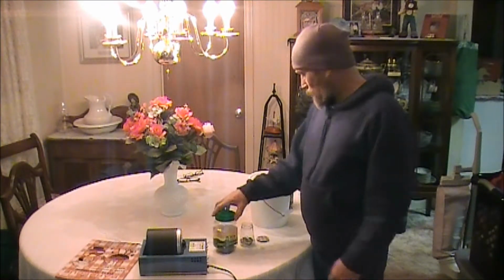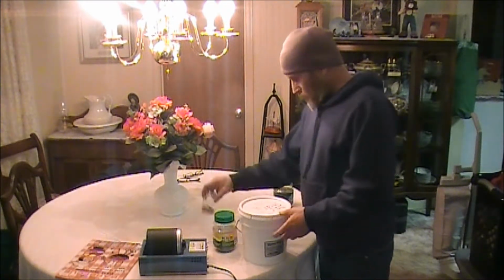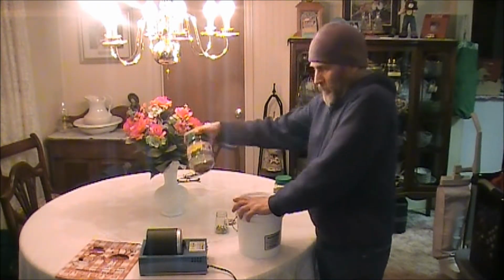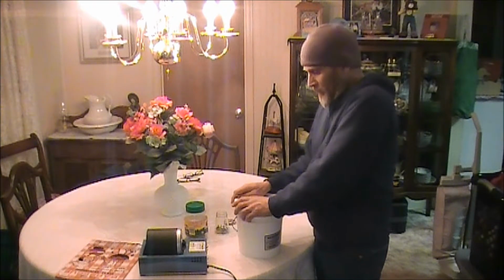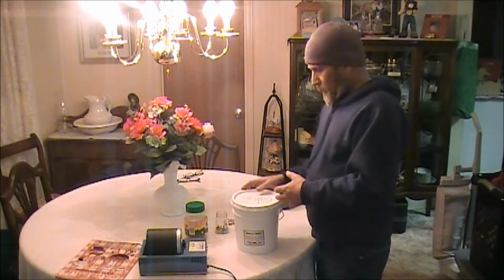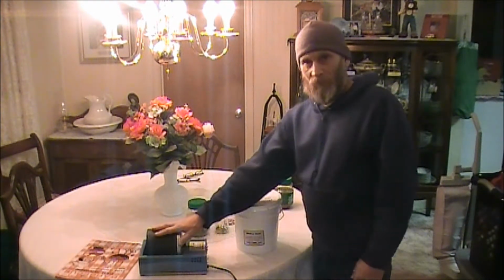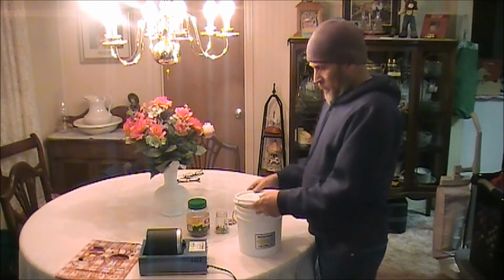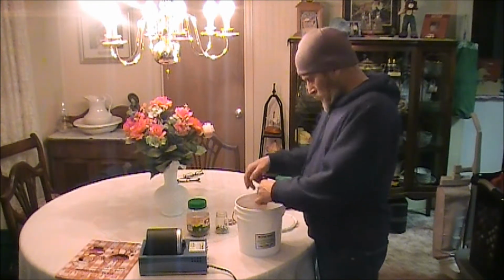But that's not all. Then you go a step further. After you've run it through the machine, generally I run it for about an hour with the stainless steel shot in there, and generally an hour to 2 hours will do the trick. The next step is I drain all the water out, dry off the rings, put the stainless steel shot back in another container, and dry out the inside of the tumbler. This is where having two tumblers would probably be a good idea, but they're just too pricey for me to buy two.